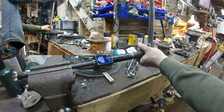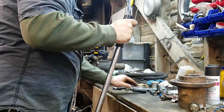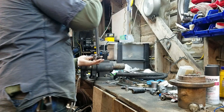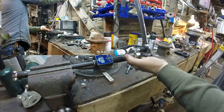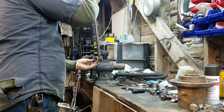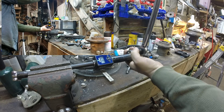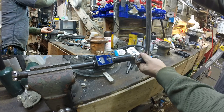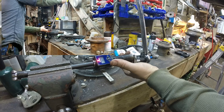Control check: 67, then 67 again. Now the crow's foot out 90 degrees away: reads 70. Let's try it about 90 degrees off the other direction: 68-ish. Now 90 degrees back toward yourself — 180 degrees from the first: 66. I'll do it again: 64.